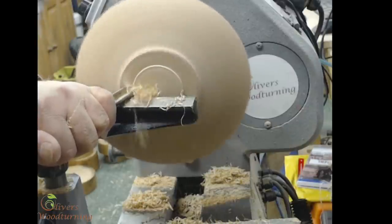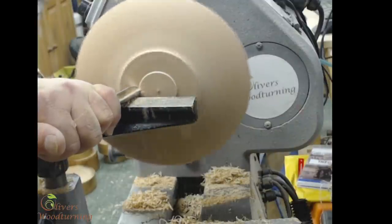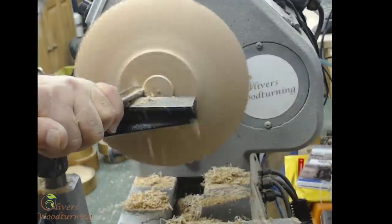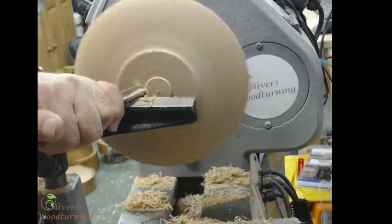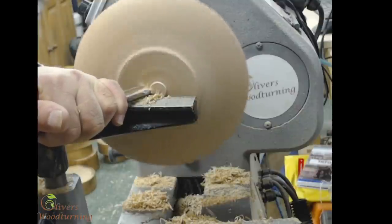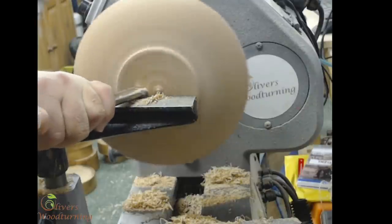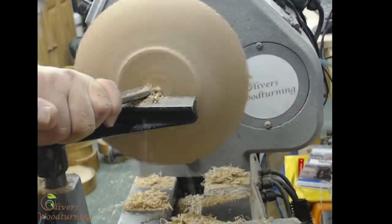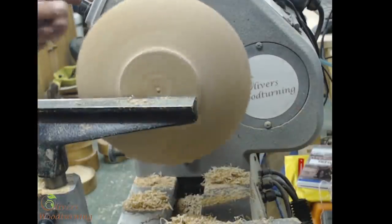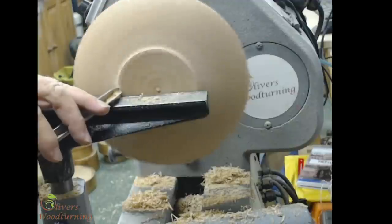Now, what you would do if you were doing these as a production, I would suggest you've got to do a phase of them, first one side, take them out of the chuck, get them to the other side. Or what I do, because I'm fortunate I've got two lathes here, is I'd have one lathe set up with a vacuum chuck, one without, and I would turn the outside on one, take the chuck off the lathe, walk over to the other lathe, bang it on the vacuum chuck so it's never left the jaws, so I don't have to mess about realigning the things. So I'm just going to come in here,